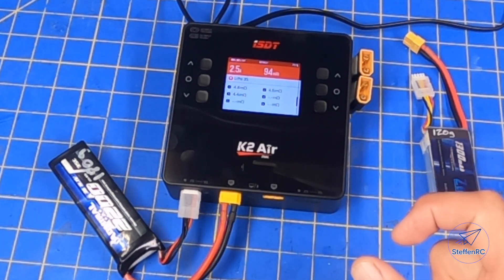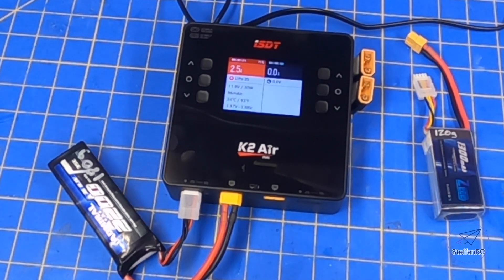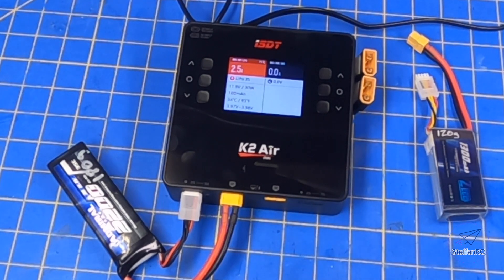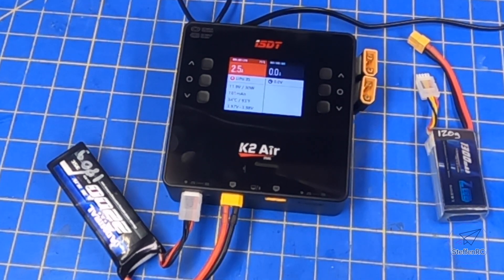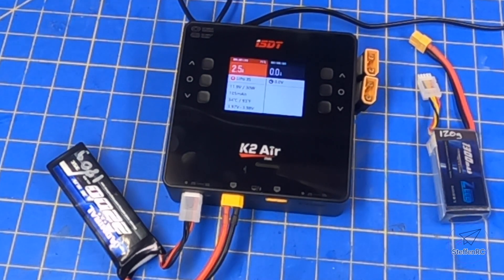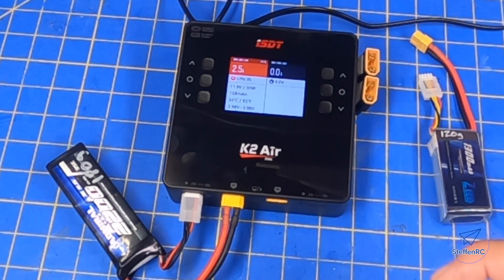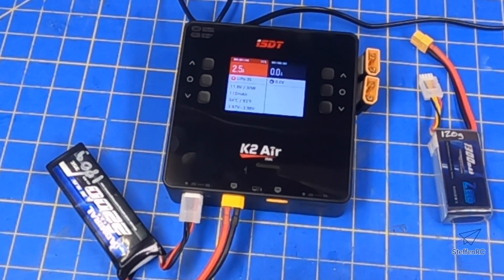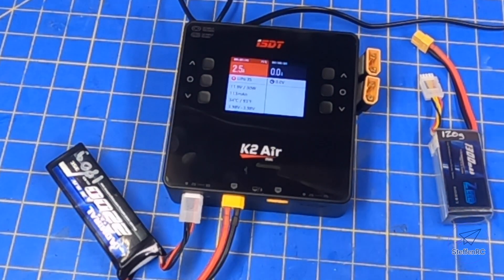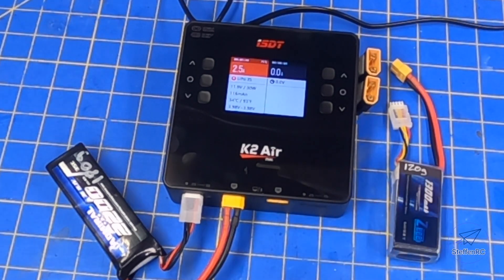Really small batteries — like a 350 milliamp 2S — the internal resistance on those usually is a lot higher. I'm charging at 1.3 or 1.4, but I just find the smaller batteries have numbers that look a little crazy as far as internal resistance goes, and they don't take the load as well. Just something to think about when you're charging — a couple things to consider as far as how you're setting it up and monitoring while you charge.